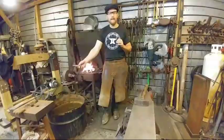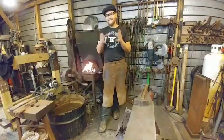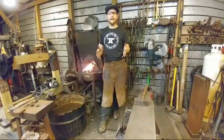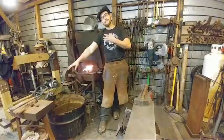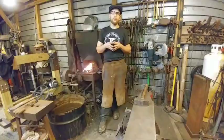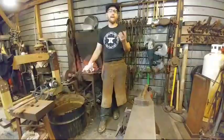The beam hammer has a 37-pound ram. It's actually 49 inches overall long and about 11 inches wide, so it takes up considerable space in the shop. And it's adjustable to work with tooling. It's been designed to work with tooling. But it's a completely different beast. The thing weighs about 350 pounds. You're not going to move the thing very easily or be very portable. So it's completely different designs. I hope that answers the question.